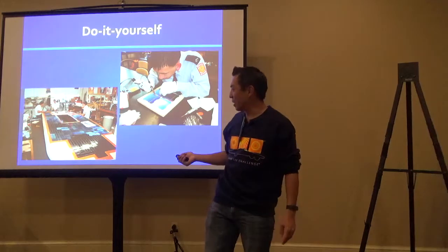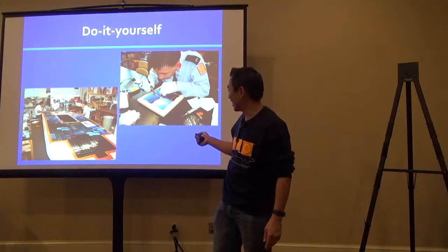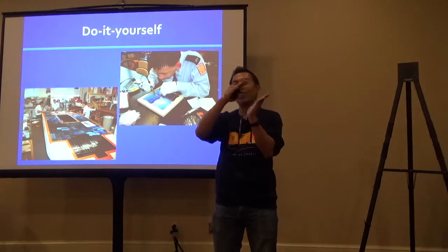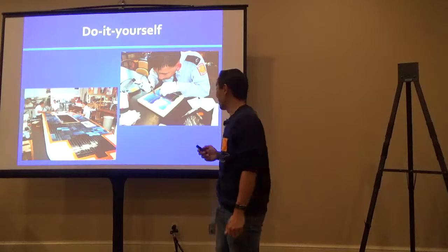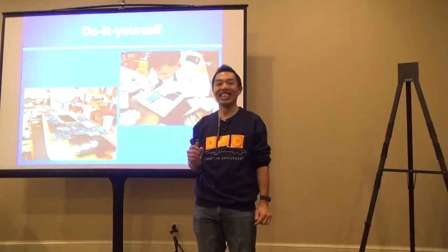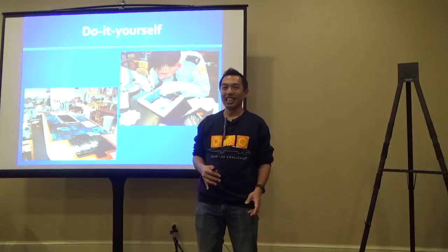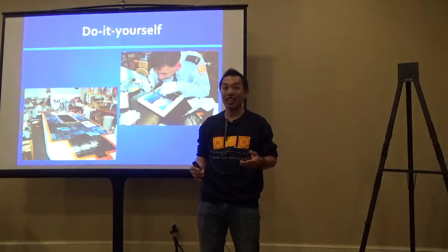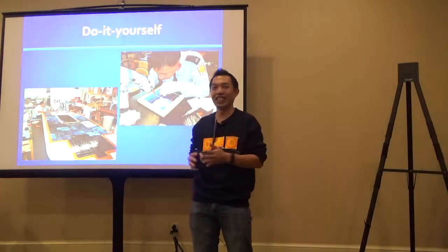St. Thomas Academy put together their solar panel using the same approach we used—wiring cells with tin ribbon, using a jig for consistent spacing, folding the ribbon underneath and soldering on the back. It's full of challenges. After that experience, I have a huge respect for handling solar cells because you look at them funny and they crack. The prefabricated stuff is better, but you still need to be careful with the semi-flexible panels since they lack the protective glass-and-frame assembly.